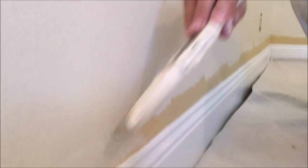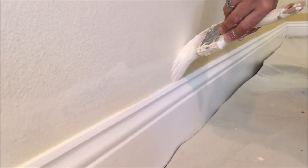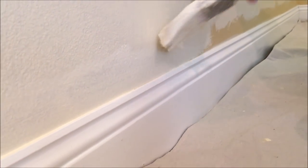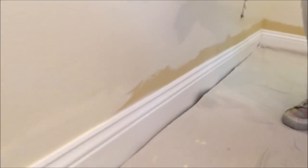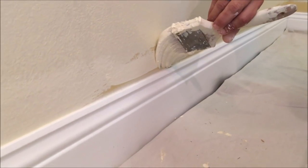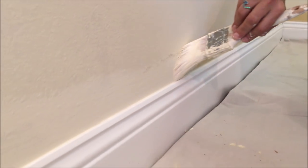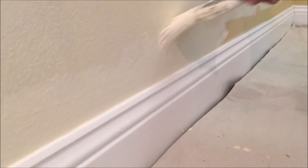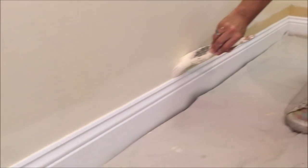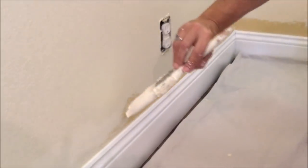If you have a yellow paint you're painting with, it's very difficult to cover other colors — especially dark ones — because the yellow tint is very translucent. Sometimes it'll take two coats of cut in, and then you might have to come back and touch up any little areas. We use a method we call dry brushing: you barely have any paint on your brush and just kind of dry brush it in and feather it out so you don't see any brush strokes.